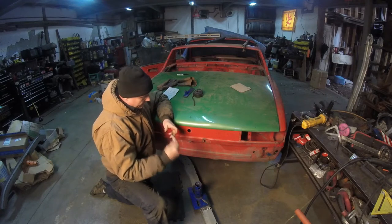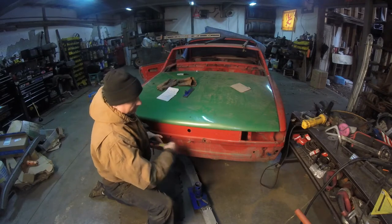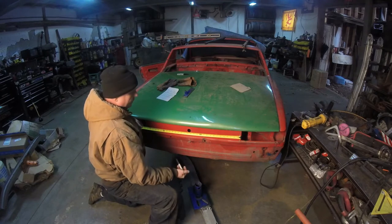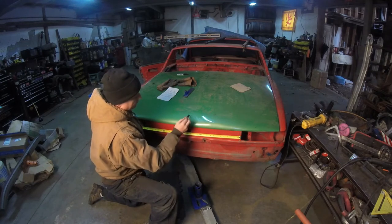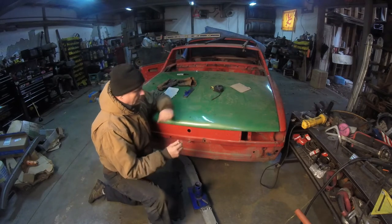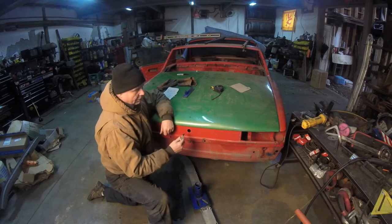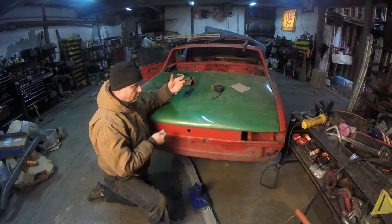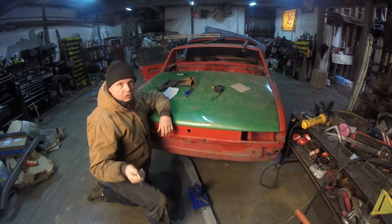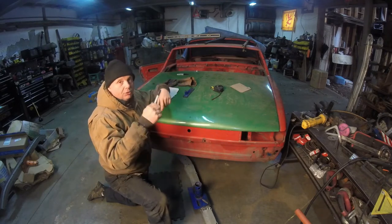We also have to go from the center, which is right here. It's really nice that they gave us that: between the two tail lights is exactly 31 inches, so there's 15 and a half inches to the center line, because I already measured it from the ground. I also have to measure all the way out to the farthest point of the fender to make sure that width will clear as it rotates around with the rotisserie. Before we put it on the rotisserie, we have to make sure, at least calculate, that it will clear everything and rotate.